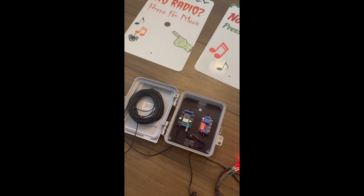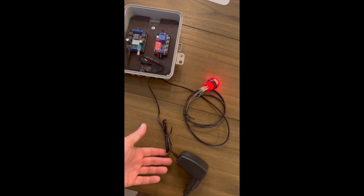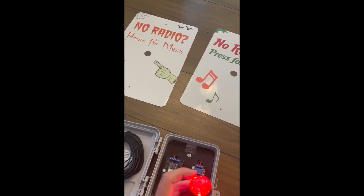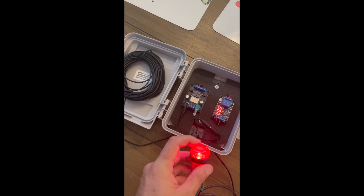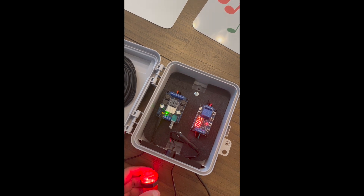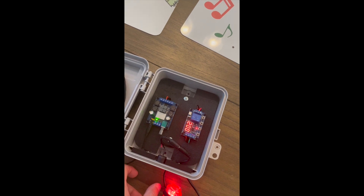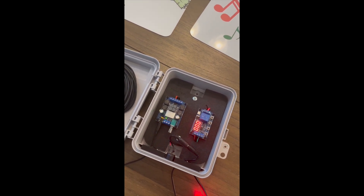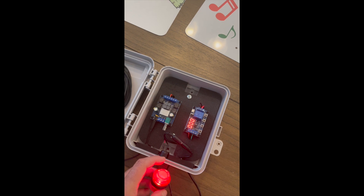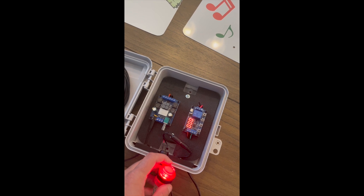I've designed the system to be as user-friendly as possible and set you up for success for many years to come. Now that we've got power to our system, I'll explain a little bit about how it works. Passers-by will press the red LED button, which will activate the relay to activate the amplifier. When that happens, the audio will emit from your speakers. The relay will allow the audio to play for however long you set the countdown timer for. Changing the time on the relay is very easy with the instructions I made. With the relay setting of P1.2, if the timer is currently counting down but the button is pressed again, the timer will reset to the beginning of the countdown without interrupting the audio.